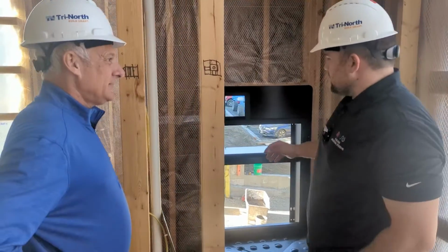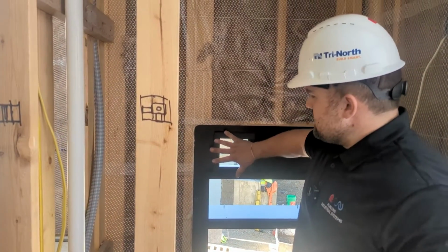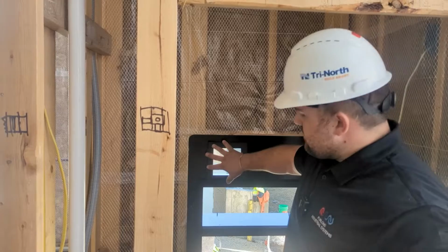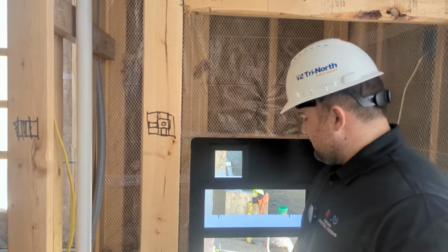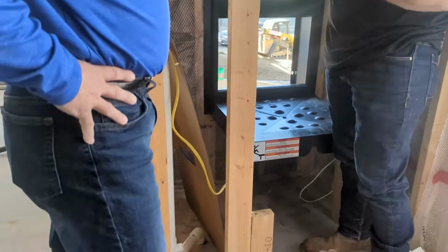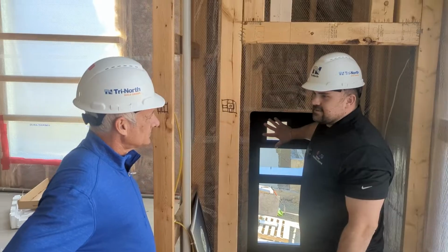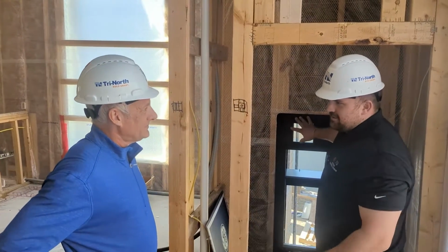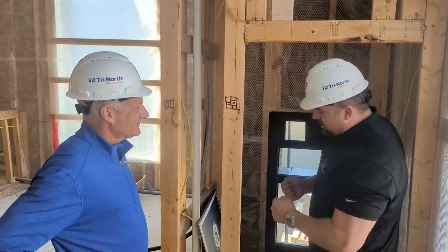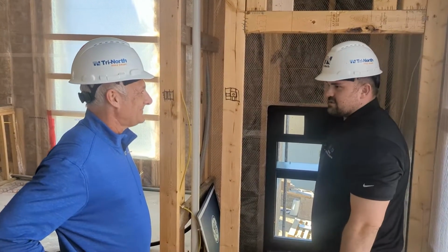So that was another huge selling point, the internal gaskets. So the easy compression here, you just had to line the unit up, make sure the height was correct, slide it on these 2 rails, and essentially the unit itself with the flange compresses this 1-inch gasket. Right. The contractor said that's easy. Right. There's no extra caulk, there's no leveling it up and screwing it in. It's simply place it, push it against the wall, and you're good to go.